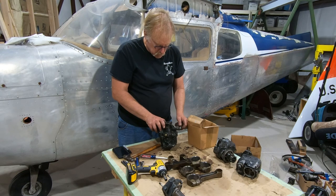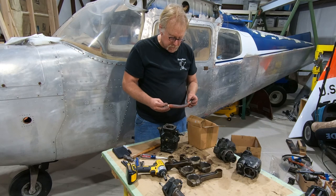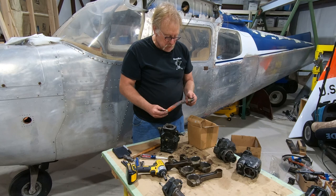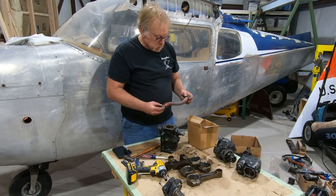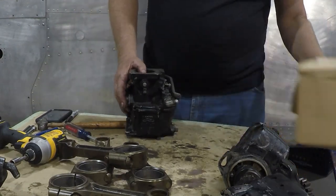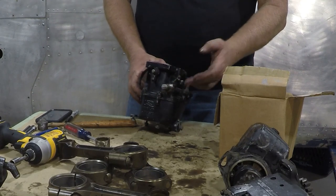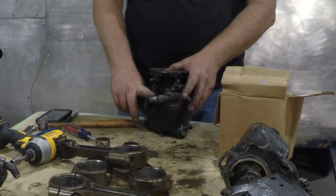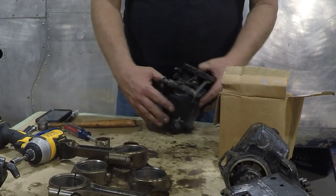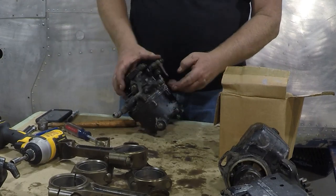So again, this is aircraft fuel line. When we send this out, you can see this staining or something, probably from exhaust. We're going to double check these hoses and replace those if necessary. But before we send this out, we're going to take pictures of the fittings and all that. If you're not sure of your shop, or you've never worked with them, take this fitting off, bag it, tag it, especially if they're very unique fittings, and then take a picture of how it's clocked, so that when you get it back, you can put it back on. So that's what's going on there.